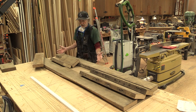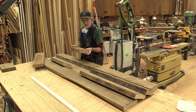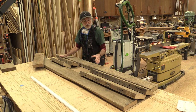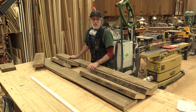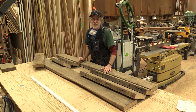And there it is. All I gotta do now is take all of this material that's almost 2 inches thick, run it through my surface planer and my jointer and get it perfectly flat and smooth, and then I can start ripping it to get the right proportions for the width of the counter. And once it's ripped, I'll crosscut it so it's maybe an inch long, and then I can position every single domino according to this template, and hopefully this time when I make my cutouts, I won't see those domino mortises when I'm done.